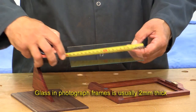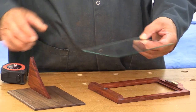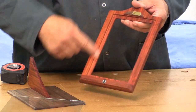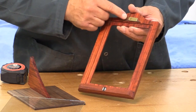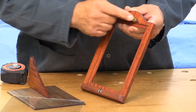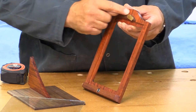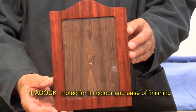The piece of glass is two millimeters thick and I got it from my local glazing shop. The dimensions of the glass are 186 by 136 millimeters, and that dimension is dictated by the size of the rebate I've cut to take the glass. At the top there's a piece of wood designed to thicken up slightly so I can put a screw in for the brass stay I've made. That piece also has the grain running that way and serves to stiffen up the top piece. The wood I've used is padauk, but you can use whatever you have.